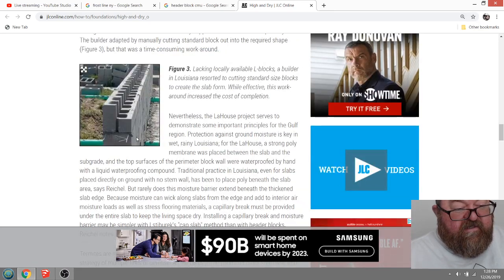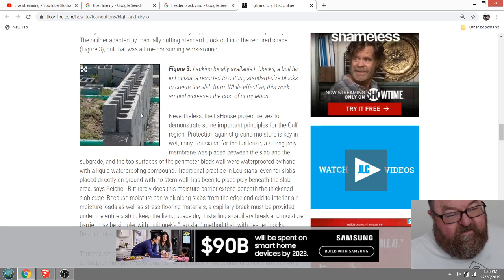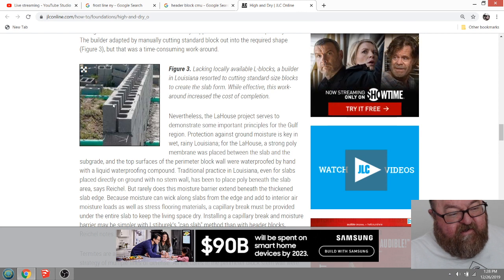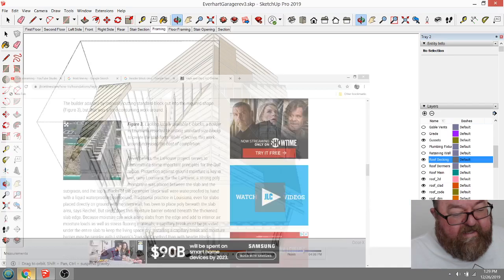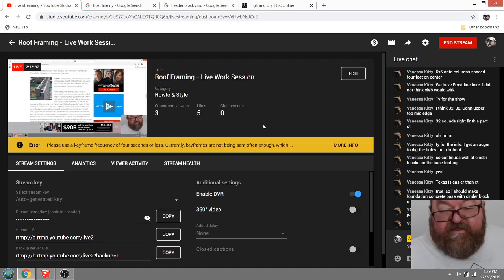See how you got two or three courses of regular block, then your top course would be the shoulder block, and then they would fill all this in with gravel, and then you'd pour concrete up to here. But if you had a very slight change in grade, you could do that. Again, I don't mind helping you out with some details. If you want to send me what you've got,